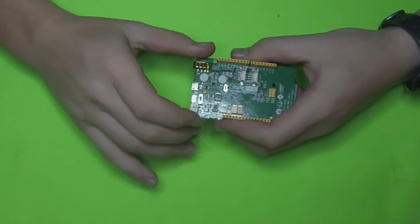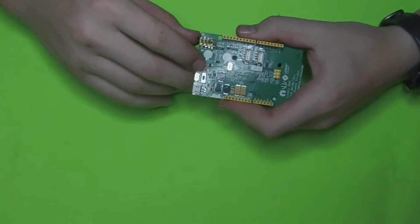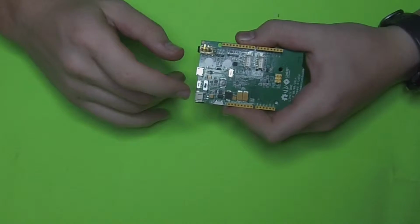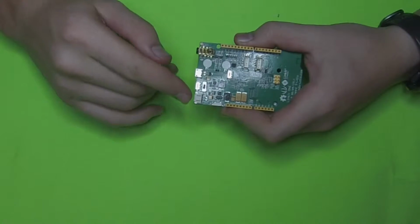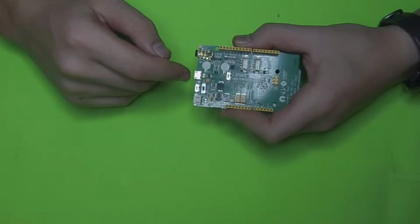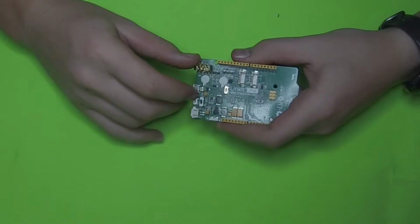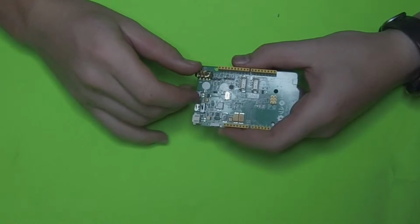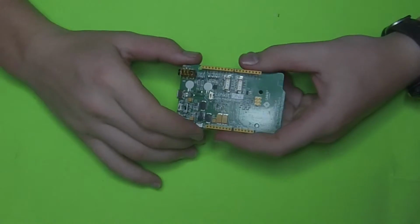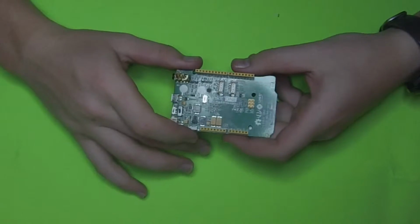And then here you have the power supply switch, this switch right here. So if you flip it towards the battery plug-in, then it will run off the power from the battery. But if you flip it towards USB, then it will run off power from the USB cable. And then this switch, I can't remember what it does. I'm going to have to look that up, but I'll put that in the description, along with links to the website where you can learn more about this board if you wish.